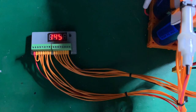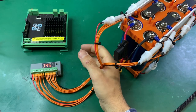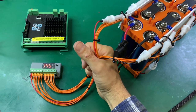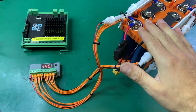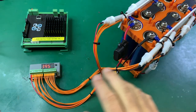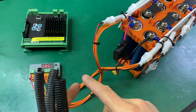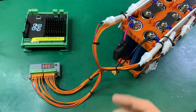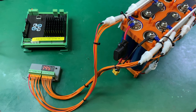Now we have lots of wires coming from the battery and we need to protect them from anything crashing or pinching. This is a demonstration pack so the distance between battery and BMS is very short, but in real installations the cables can be one, two, or three meters long. You need mechanical protection from pinching.